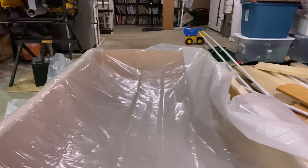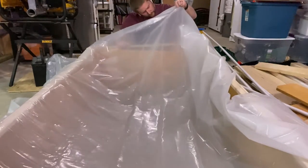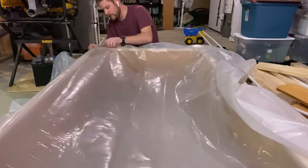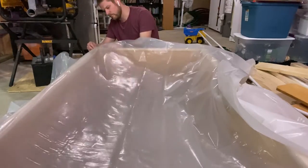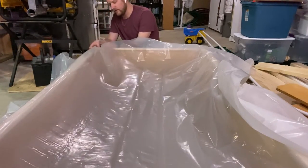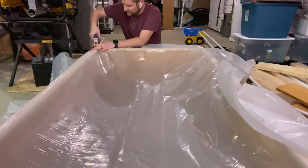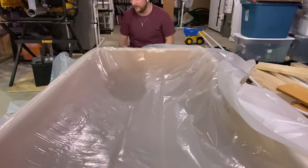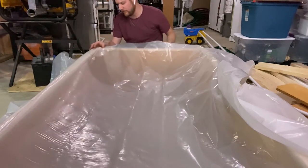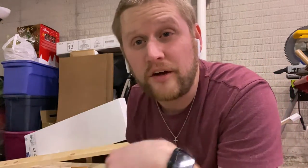Now we can go down to the other side, pull it, and get it to the length we need. I'm going to go ahead and start stapling it in here — do a couple of staples. It's really dipping down right here, but when we do the other side we'll pull it pretty tight. I'm going to pull it tight here and get this side in. It's going to be difficult — I'm not going to lie to you, but it's worth it. So just take your time. If you've got a better way of doing this, drop a comment below to help other people out. Just keep going down, pull it tight, staple it in until it's pretty flat.